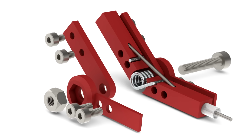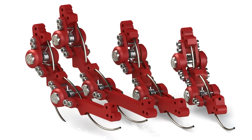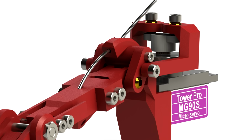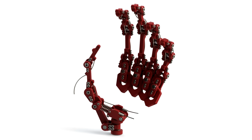The further the distance you put between your actuator and the thing that you're moving, there's a lot of wiggle room between all the components in that chain, and so eventually it is inevitable that components will come out of calibration. So eventually the fingers won't be in quite the same positions as they were to start with, and because the inner cable has room to move in the inner sheath, as the fingers move around and the outer cable is moved around, there's the potential for the fingers to move slightly, just as the tension of the inner cable is moved slightly.